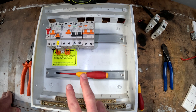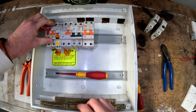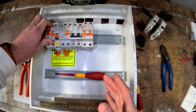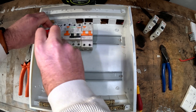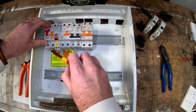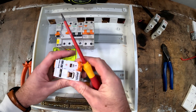There are two main ways that you could wire this up. One would be that you're just looping wires from one to the next, which is fine. The other way is they give you bus bars — unfortunately I couldn't find a bus bar — but a bus bar or a comb is just a piece of copper with a cover on it, and it lets you connect from one breaker to the next quite easily without looping a wire from one to the next.